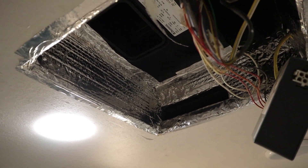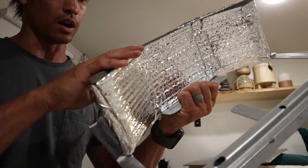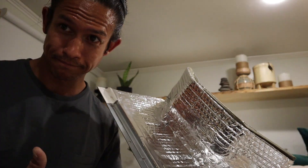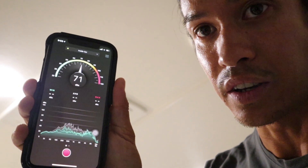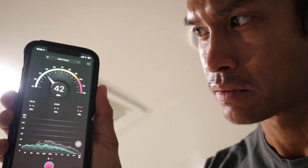There is the finished product up top — that's pretty well sealed up. And here is the finished product on the plenum. Man, Elon Musk would be proud — this thing is ready for outer space. Now all that's left is to put everything back into place and test the decibels to see if it actually made it more quiet. Similar conditions as before: resting room tone is 41 to 43 decibels. Now we're going to turn on this AC and see how it's going.